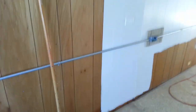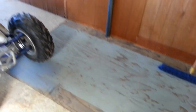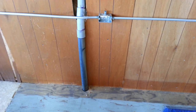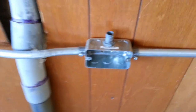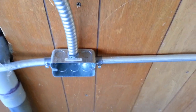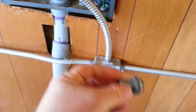It's been two or three days later. I had to replace a big section of the floor here — that really wasn't part of the scope of the video. I moved the electrical panel into the wall and the wall and floor were rotten, so I had a big bunch of replacement to deal with. But we ended up getting the run done. The last box has the attachment for flex conduit, and the flex conduit screws on here. We'll cut it for length and run it up into that covered box right there.